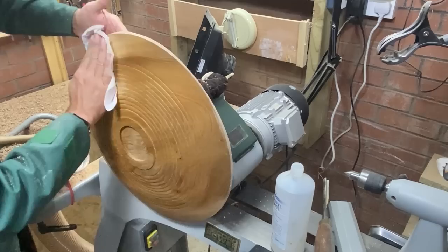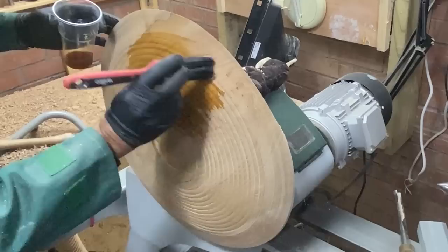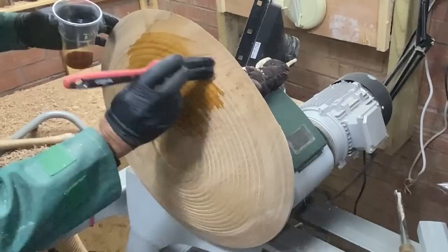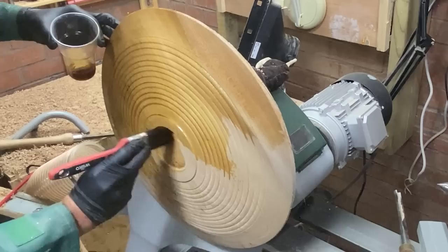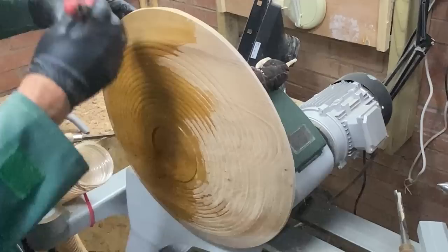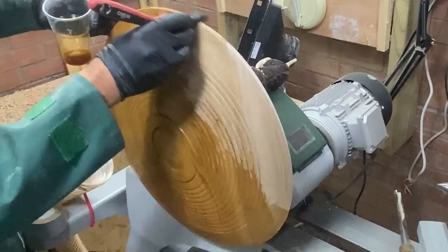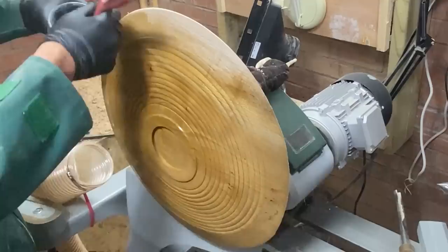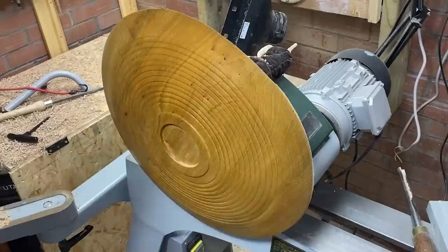Right, that's the sanding. I'm going to clean out the pores with isopropyl. The sanding was an absolute horror. Beadings look beautiful but they don't make for good fun when you're sanding. And with that catch as well, I went back in to try and touch something up — even led to a slight redesign. All fun and games. But anyway, I'm ready for the next step. Right, let that dry and I'm going to put a sealer on. I'm going to put a shellac-based sealer on this. I'm putting it on with a brush just so I can get it into all the grooves nicely. I'll let this sit for a while, then I'll come back and determine whether I need another coat. I didn't go for the blonde shellac because I think elm, especially Scottish elm, really looks better with this kind of darker colour.